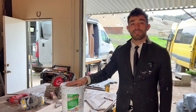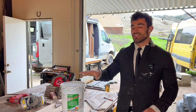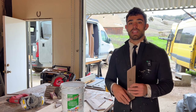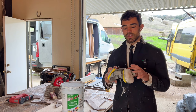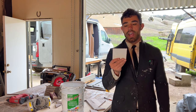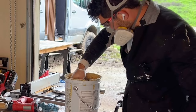With the front section done, it's time to start gluing. I'm working with Eco 977 flooring adhesive for two main reasons: heavy traffic so pieces don't move, and most importantly expansion and contraction — especially in a van. With hardwood, it expands width-wise with heat and cold, so this adhesive helps mitigate that. When working with this, it's very important to have the correct PPE — 6003 cartridges on this 3M mask, or 6001 black sticker works as well — definitely don't work with this without the proper mask, and wear gloves. I'm applying it with a quarter-inch V-notch trowel, sometimes a bigger one.